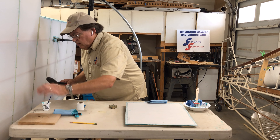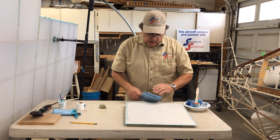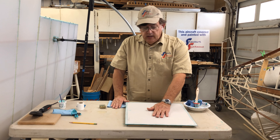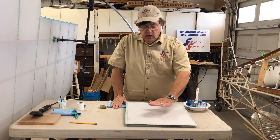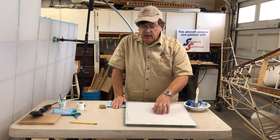Make sure you have a clean paper towel because you'll want to wipe this out. I'm going to start from the middle of my panel and work outbound, doing no more than about a six-inch square at a time because in this heat the glue will start to gum up fairly quickly. This is going to be a finish area — just like when you put on finishing tapes or an inspection ring, you need to do the wipe so you don't have excess. I'm using the bristles of the brush to work the glue in, and you'll see a color change very quickly as it penetrates the fabric and bonds to the plywood underneath.